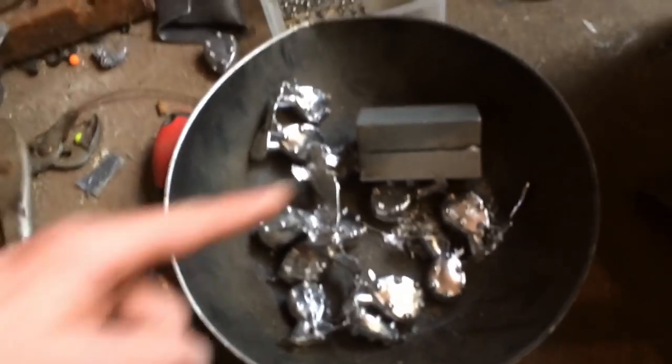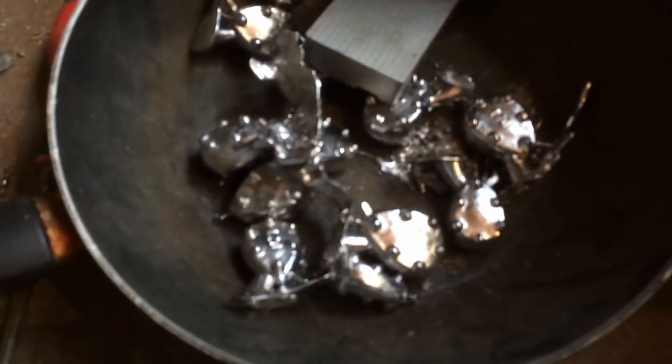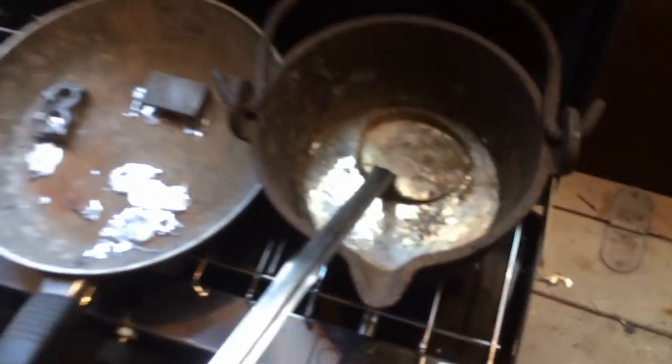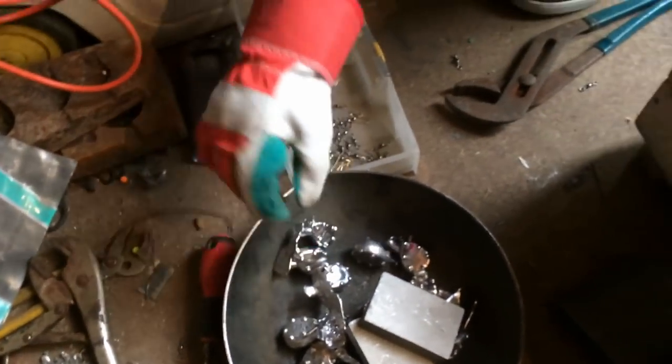That's the Aquapedos — a pair of ones. Look at that — fresh weights, brand spanking new. We've made those in the space of six or seven minutes. Once the molds get heated up, you can really work. But never fill your pot right to the top — leave it just over half. That's just enough to make a load of weight.